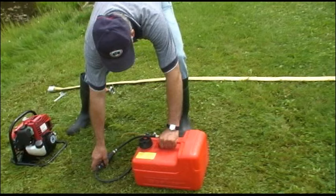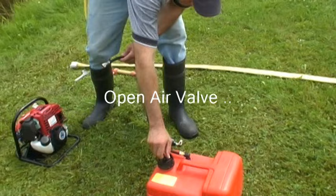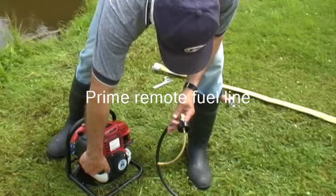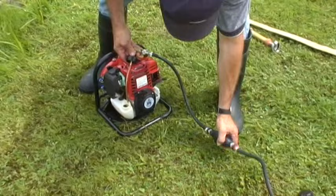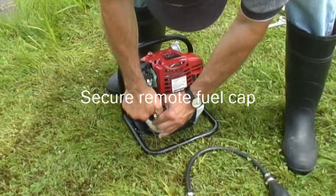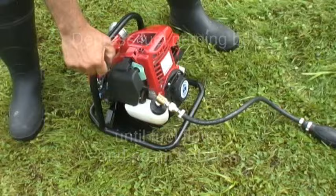The WIC 84H has an optional remote fuel connection. Note that the remote fuel tank should be at level or preferably at a slightly higher elevation than the pump. To set up this connection, we first open the air valve on the fuel tank. The remote fuel line then needs to be primed: connect the remote fuel cap, remove the standard fuel cap, and squeeze the priming bulb until a small amount of fuel comes out of the line. We then disconnect the fuel line connection to screw the cap tightly in place and reconnect the fuel line. Depress the fuel priming bulb until you observe fuel flow and there are no more air bubbles.